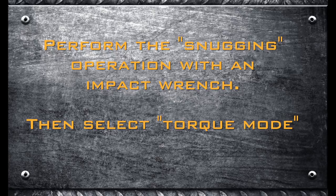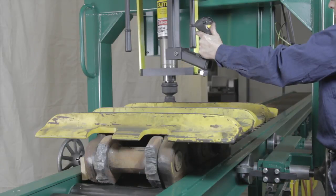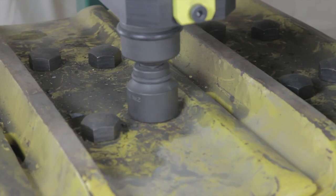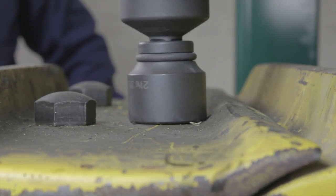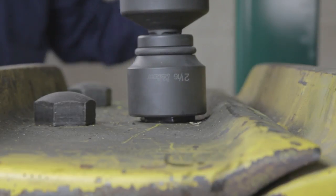This can be accomplished by pressing the Torque Mode button, which locks the wrench in the high torque mode, bypassing the rundown bolt snugging sequence and going directly to the final set torque or pre-torque if a torque turn sequence is specified. When removing track bolts, the standard sequence places the EL-10,000 in high torque mode to break the bolt loose. Once the bolt is loose, the EL-10,000 automatically switches to the low torque, high speed mode to spin off the nut. In a case where an old bolt has damaged threads requiring greater than 250 foot-pounds of torque to remove, pressing the Torque Mode button will lock the EL-10,000 into high torque mode to remove the most stubborn bolts — to the point where, if the thread seizes completely, the bolt will break.